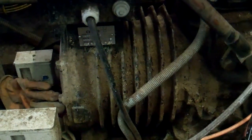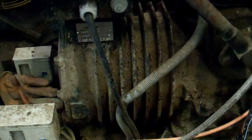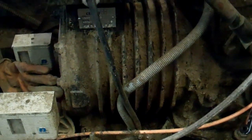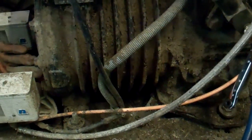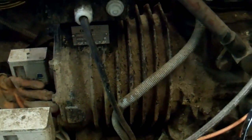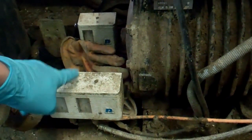I did think it might have been a shortage of refrigerant originally, but now we've had a bit more information, we've got a couple of things to check. Both units run off the same clock, so that doesn't point to it being an electrical problem. I think the favourite is going to be the pressure switch being out of calibration.